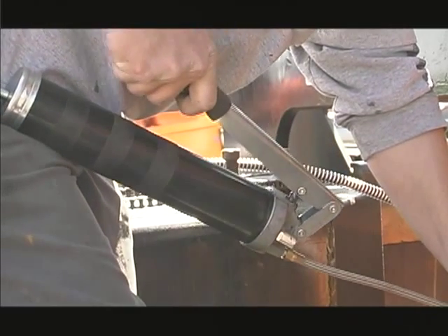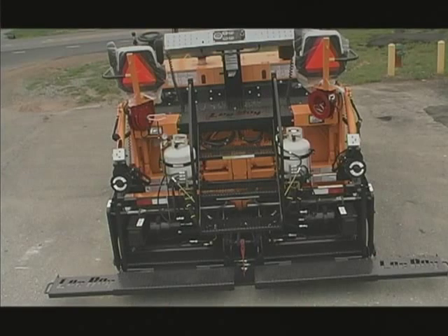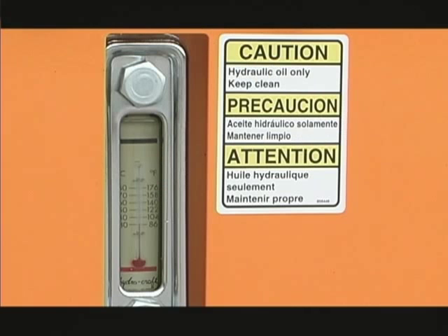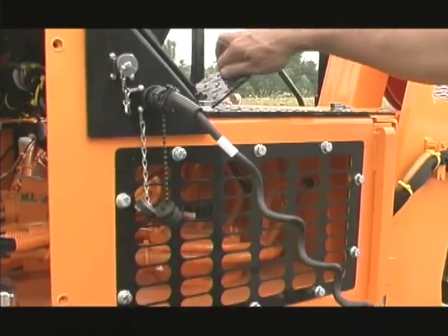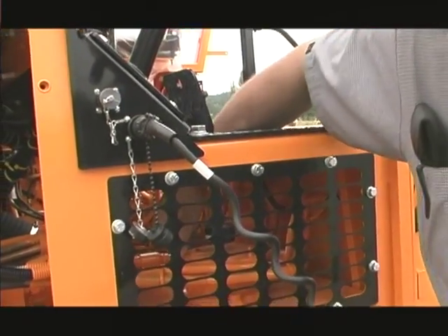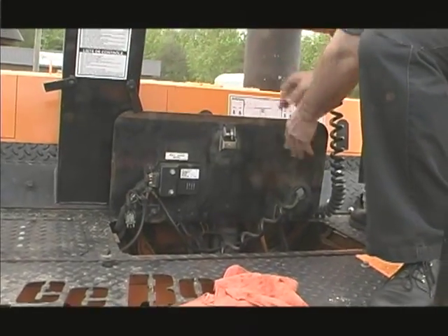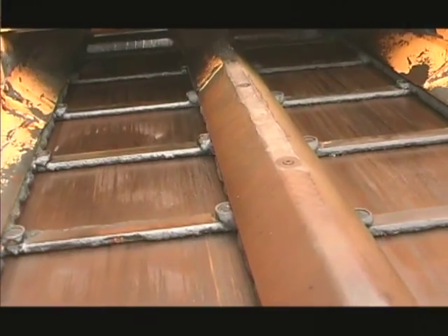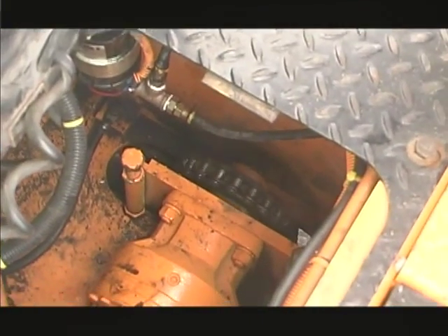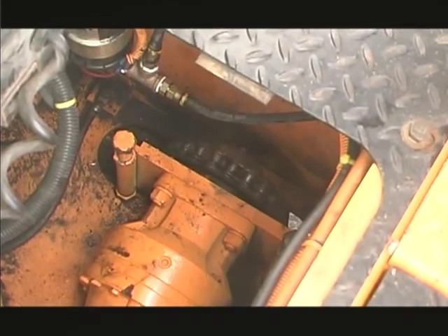At the beginning of each work week, perform weekly checks and maintenance as described in the maintenance manual. Begin by looking at the hydraulic fluid gauge and adding oil if the current level is low. To fill the tank, remove the top of the return filter and add hydraulic fluid as specified in the manual. Check the conveyor drive chain while the conveyors are turning. If the drive chain has excessive loose motion in it, the chain must be adjusted.